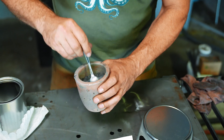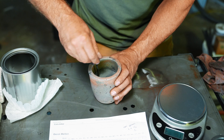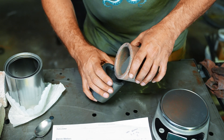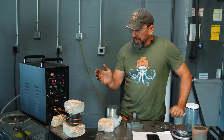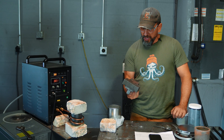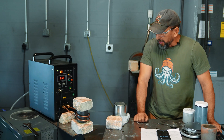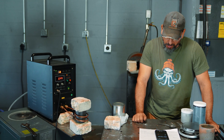The super cool thing about using the induction furnace for crucible work is that the magnetic fields will stir everything for you. If you don't have a top on it, you can actually see your melt charge spinning from the electromagnetic field — super cool. The crucible is loaded, sealed, and everything's mixed. We're going to use a heavy die to hold the pedal down and run a timer for five minutes. In my experience, about a minute and a half it'll be pure liquid. We'll let it run for an additional few minutes to make sure all the air bubbles are out.